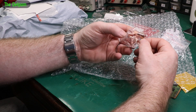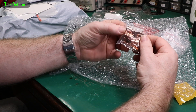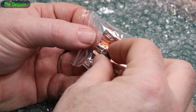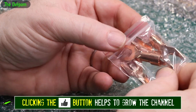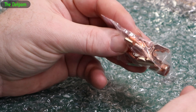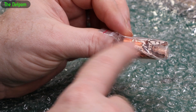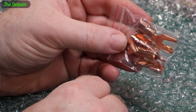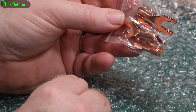Four copper spade terminals. These are quite expensive. Are they real copper or some kind of coating? Let's see if they're magnetic — that's always the first clue. Strong magnet — not magnetic, that's a good sign. That means they're not steel. I did get some similar ones before but these are different, better ones, and also quite expensive. These can go over binding terminals, binding posts. These are crimped ones — I've got some before which were like a banana type fitting, but these are crimp-on ones for wiring. So this is how I can make up some cables, some test leads, and attach them more easily to binding posts.